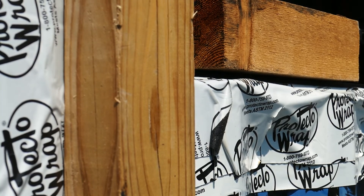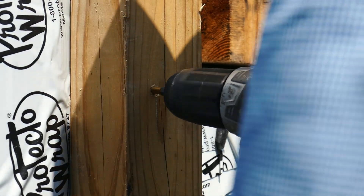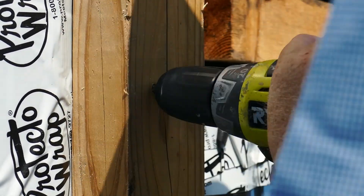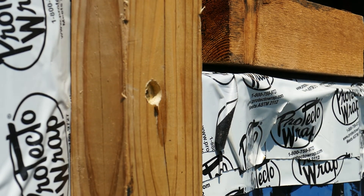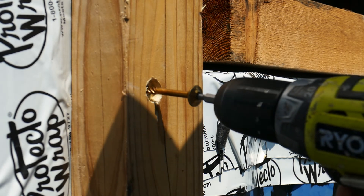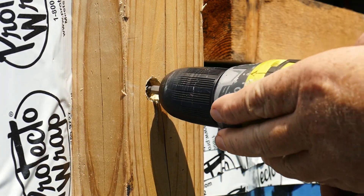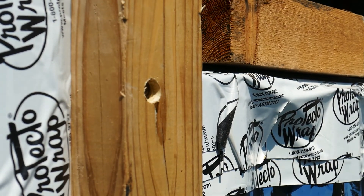The next step is drilling. I'm putting the drill in ever so slightly beveled upward, so anything on that screw would have to go uphill into the house. I countersink it a bit, then bring in five-and-a-half or six-inch construction screws with a Torx head. Watch how it tightened up that gasket — it drew the whole protective wrap tight against the container wall. I know that won't leak.